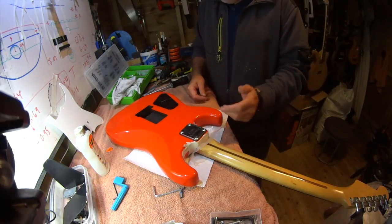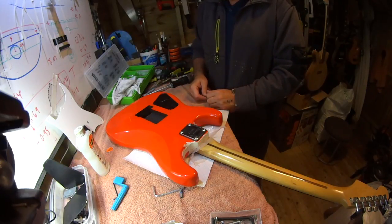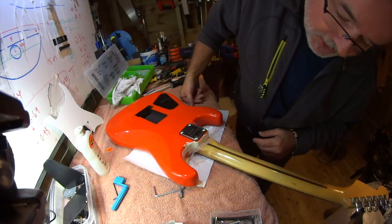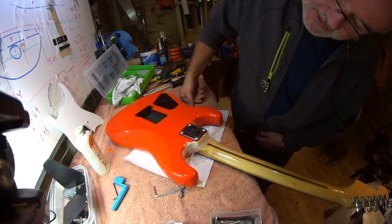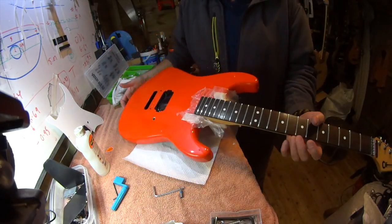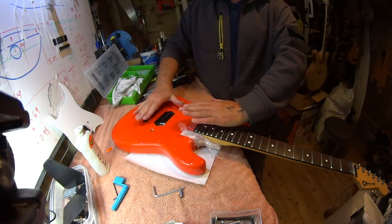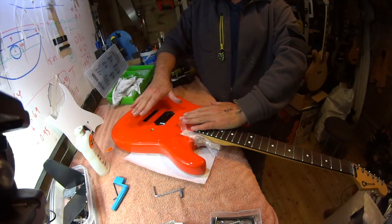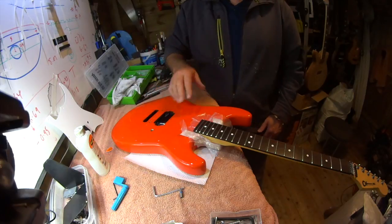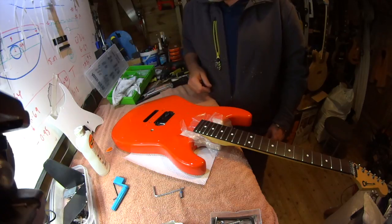Well, you never know, I'm hoping that's given us our homemade wedge, because it's trapping whatever resin's in there, but I could be wrong. It might be an ugly mess, but it's clearly in place, and now we've got a different angle coming through there. This is now brought up to meet the strings, so we've got some upward movement, but more importantly, we can start from dead on the frets and then move away for the low action this guitar deserves. That's the point of shimming it.